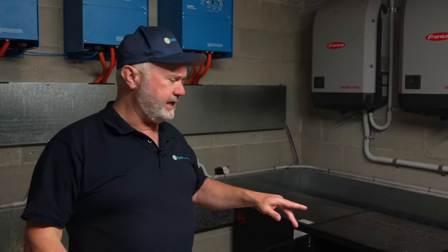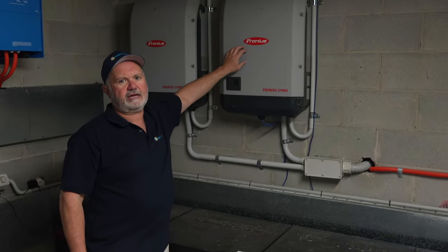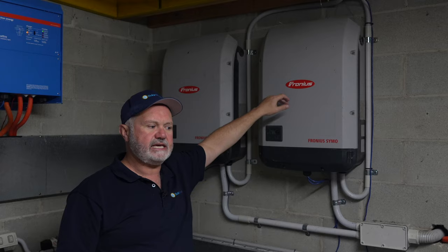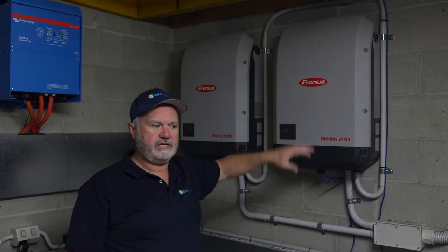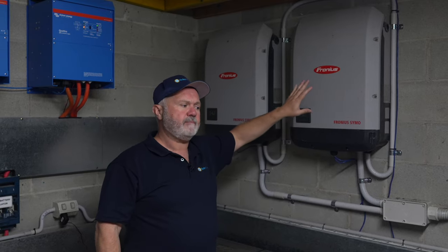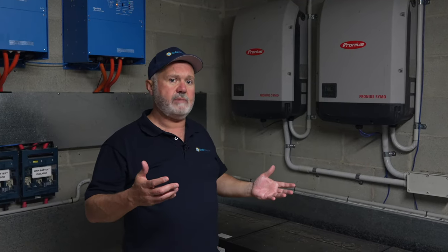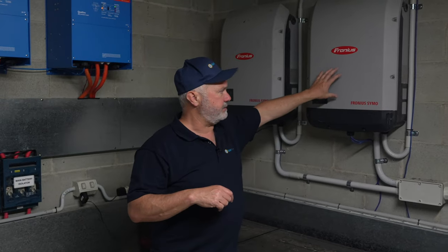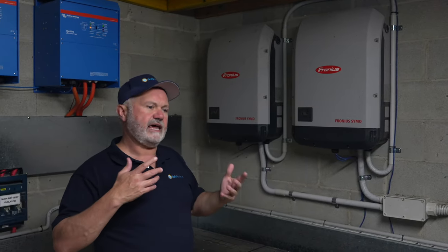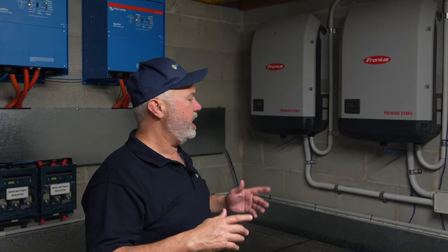One of the things my installation company does quite a lot is we sell these BYD batteries with a Fronius Symo — a grid-connect string inverter. But Fronius also make an all-in-one battery inverter where you can DC-connect to the inverter and your batteries and run an off-grid system or even a hybrid system on grid as well. This is particularly relevant if you're looking at a bigger battery solution in a rural area where ground mount is an option. I'm not sure off the top of my head whether something like the Fronius hybrid inverter can work with Enphase or SolarEdge power optimizers or Enphase microinverters — I'd have to find out.